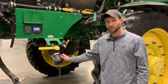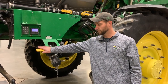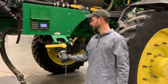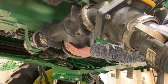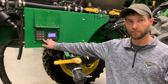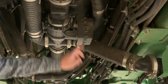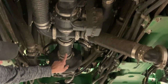On the machine itself, I can show you the same thing we just saw on the display. This would be our manually open valve going into our solution system. Our main tank strainer is right behind it. This would be our keypad with our button we want to push to open that valve on the bottom of the tank. Underneath the machine, this is our main solution valve. Our solution comes in here, goes to our solution pump.